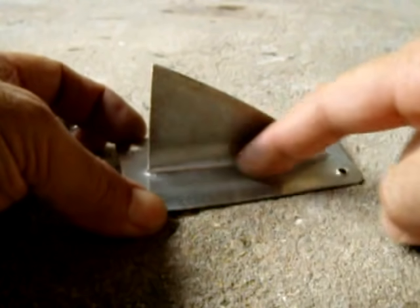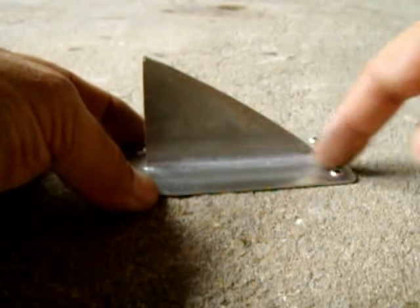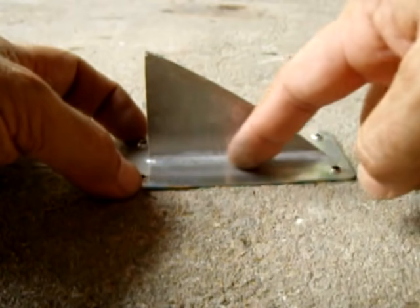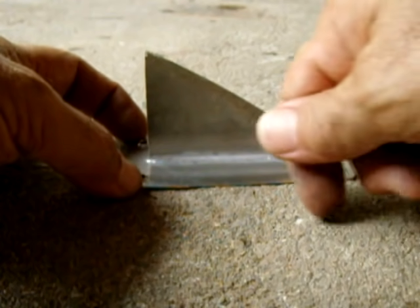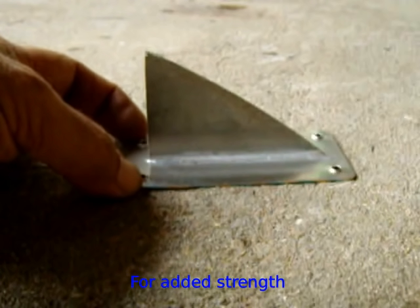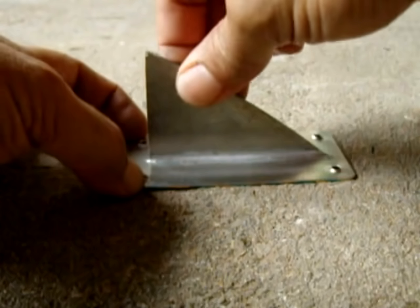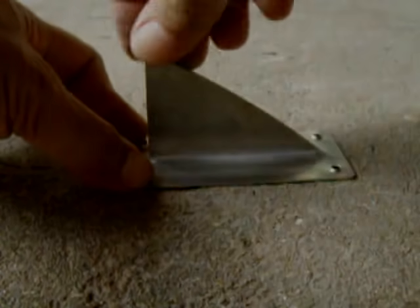Normally when it's heating up, you wire brush it the way I did — once you heat it with the torch. Once you see the brazing rod start to melt, get the wire brush and rub it in, working it into the metal. Once that's done, apply the rod all the way through. I didn't do it that way in this video, but as you can see it didn't make much of a difference.